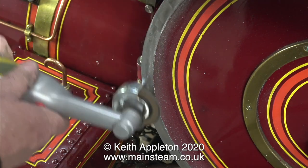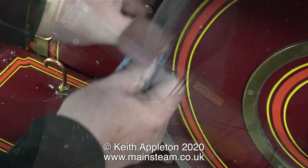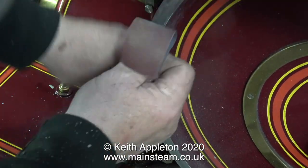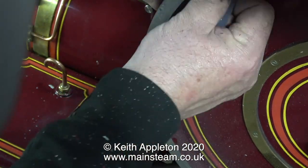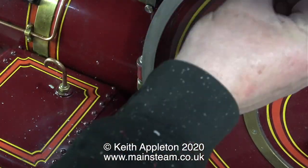So what is this wondrous tool that I'm using? Here it is — it's a Proxxon motor tool. It's nothing more than a very small, high quality battery powered angle grinder, and the wheel on it was the one that was on it when I bought it. As I mentioned, it's a flapper wheel. In the end though, I felt it was best to finish it off with a piece of coarse emery cloth. I will work down the grades of emery cloth down to wet or dry sandpaper until I get a really fine finish on the outer rim of the flywheel all the way round.